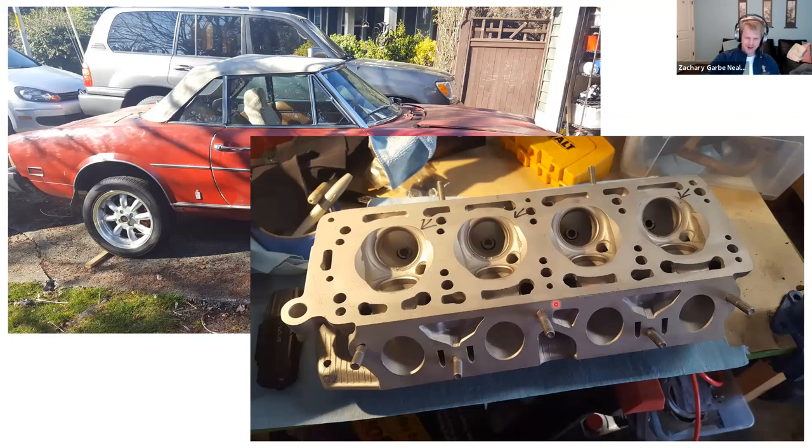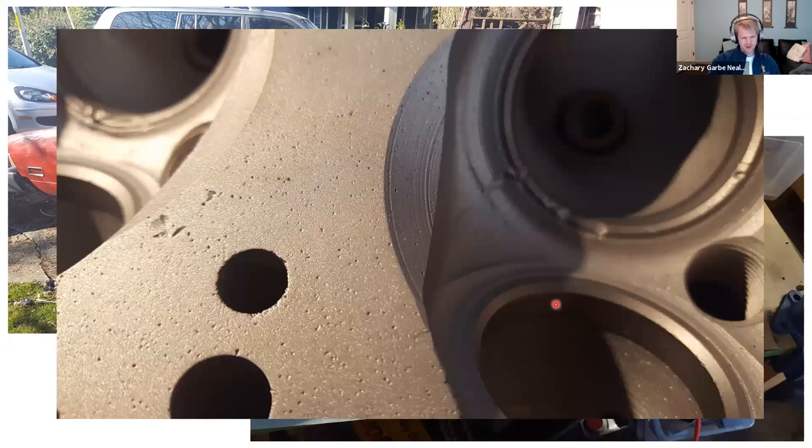What I wanted to point out is that these engine blocks are typically sand-cast aluminum — you guys are familiar with sandcasting. I wanted to show you some of the surface features of this resurfaced engine head block. You can see the porosity in the sandcast; it has very high porosity, just evident through visually inspecting it.